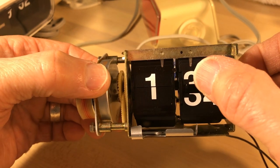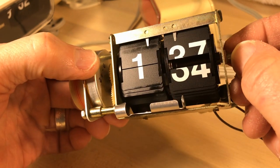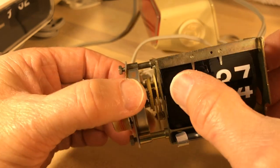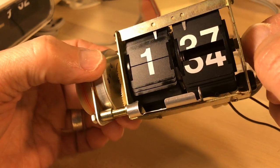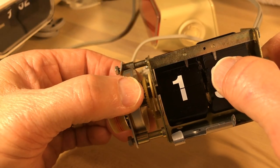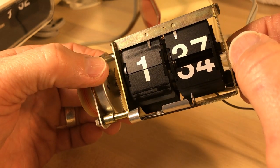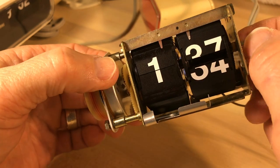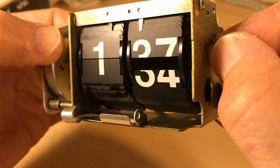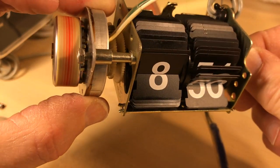That silver thing there — I call them tines — they hold back the tiles. Somebody's cleaned or lubricated these tiles; we'll go through and wipe those down, no problem. In the patents they call these arresting fingers — I always thought that was funny when you read some of the early patents. Those little things that hold the numbers back are called arresting fingers. That arresting finger is losing its grip on number 37, so this clock motor is working. The gearbox inside is functioning.